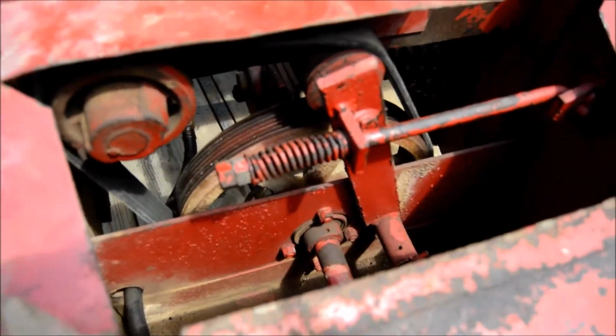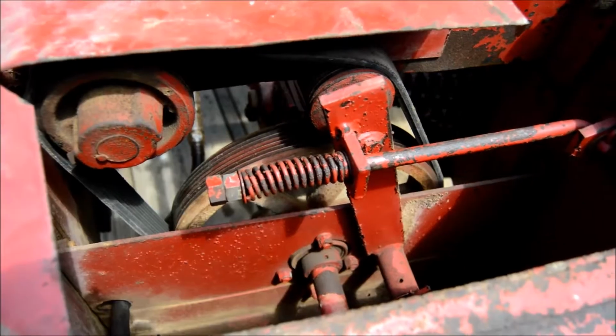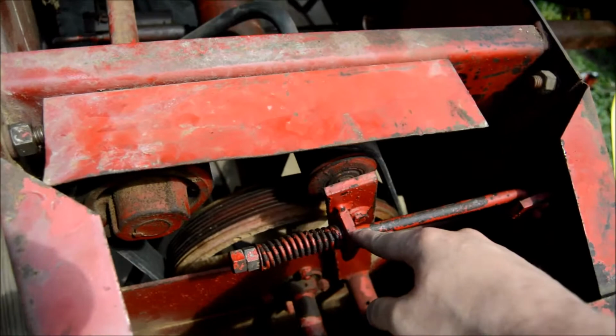We just got done putting the belt on the pulley with the tensioner. The tensioner's right here. We just got that all set up. And you can see right now I got to clean this out some, but we removed those two housings, and that's where those two T's are gonna sit. And then I'll strap them down, and I'll drill a hole on the one side, run a bolt down through, and they'll be pretty secure.